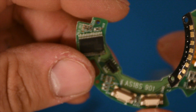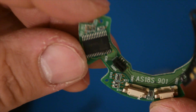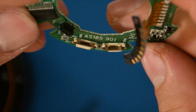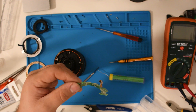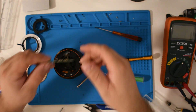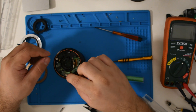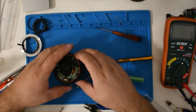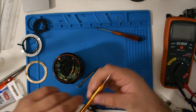As you can see, the ultrasonic cleaning device did its job very well. Only one leg is darker than the others, but contact doesn't seem to be affected. I don't want to reflow with a soldering station at this moment because I don't want to damage the pads on the board. I will build and test everything again. I'm pretty sure the main chip is the problem, but after testing we will know better — let's get started now.